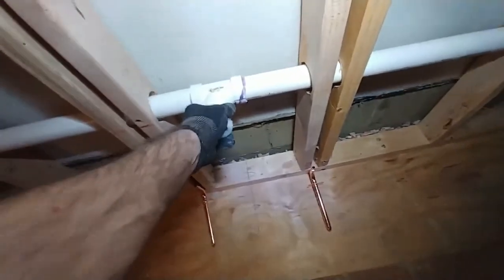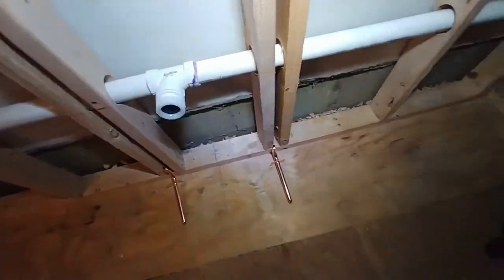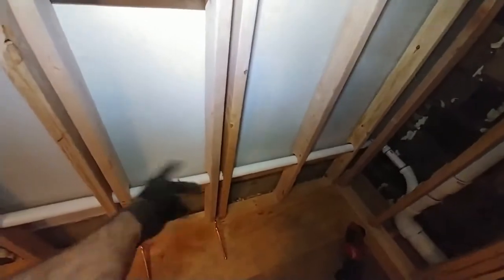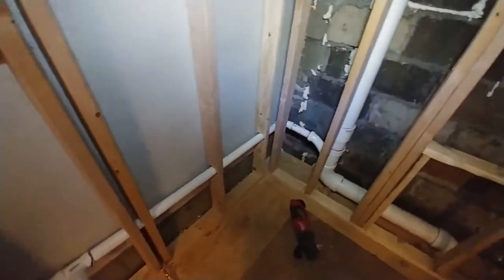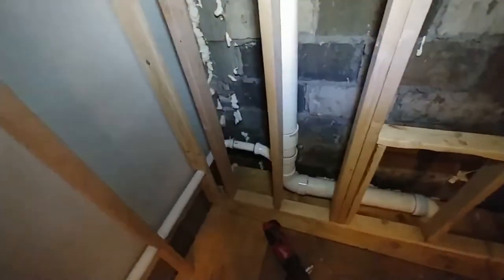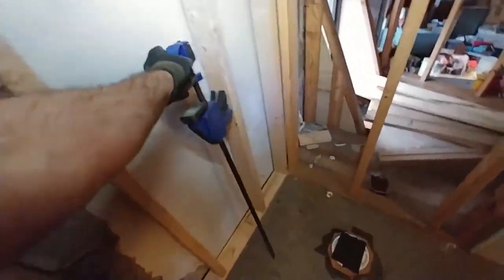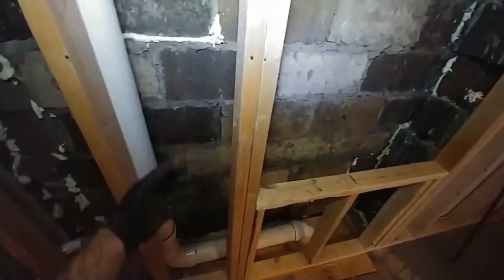Just to tighten this up in here, I'll probably squirt a little expanding foam in there, and that's a 2 9/16 hole, which makes it no problem to put 1.5 inch pipe through and 1.5 inch fittings in there if you end up doing that much. And then over here, I framed this out like a window hole, and we're going to make use of the extra depth here, even though it's going to be mostly full of insulation.